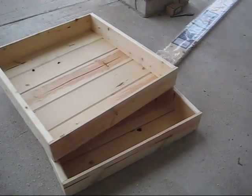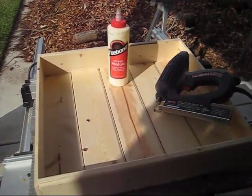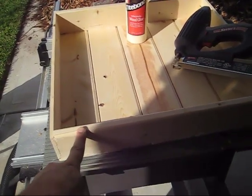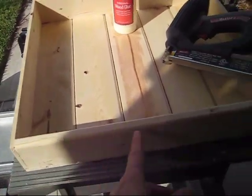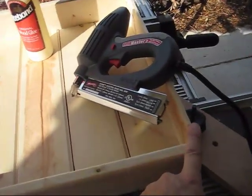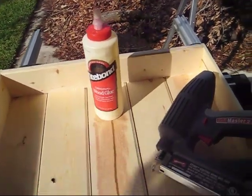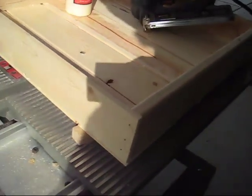Look in the description box below this video for links to all the materials I used in this project. That was a pretty quick project. It went together very easily once I had the right materials and the jig set up. What I did is I ripped this 1 by 4 furring strip to 2 and 3 quarters inches in height, then put it on the jig and cut everything 18 inches long. I also ripped the two end pieces of paneling to 2 and 3 quarter inches. Everything is 18 inches square. I used some wood glue and a brad nail gun, glued everything together and it worked out great.